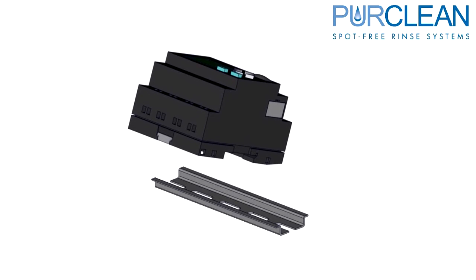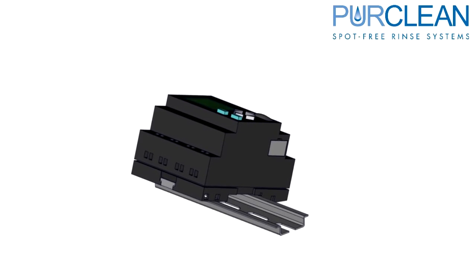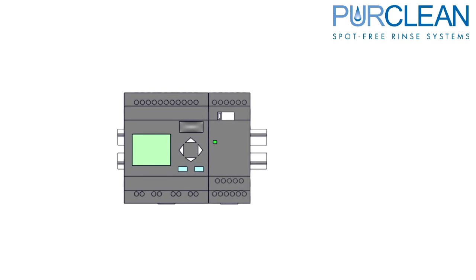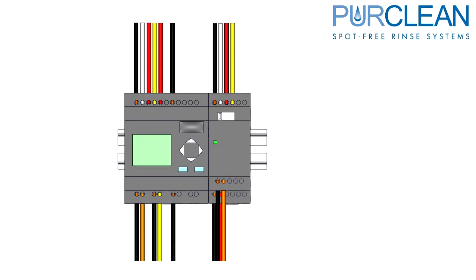After pulling the PLC out of the box, place the PLC onto the DIN rail using the top edge to rest on the rail first, and then slide down and push the PLC onto the rail at the bottom. Reconnect your input and output wires according to the way they came out or the wiring diagram supplied.